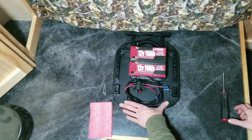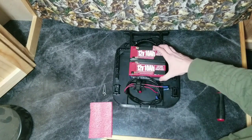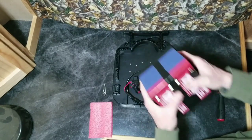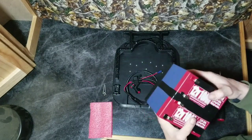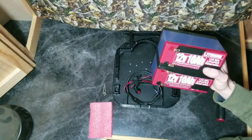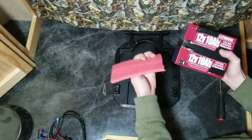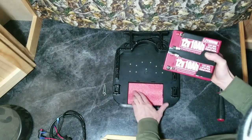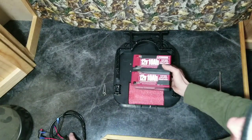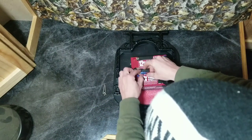We are going to start with these pieces: the lower base, the plastic handle, and two 12-volt 10 amp hour lithium batteries. I taped them together and turned them into one - you can make them removable, but I am making mine so they are part of the unit and held tight. Take the little foam piece, about a quarter inch thick roughly, and set that in there. Before I drop the battery down, I'm going to plug everything in.